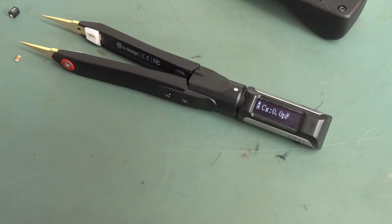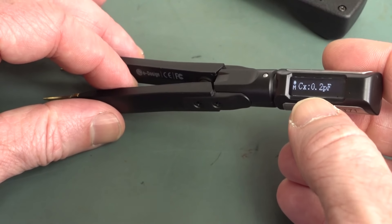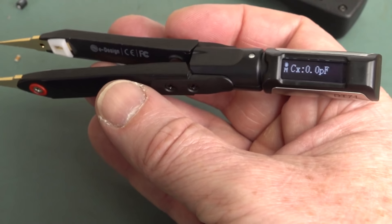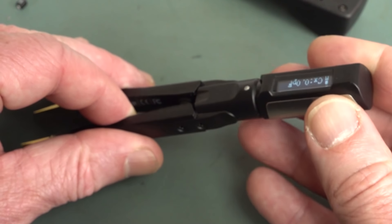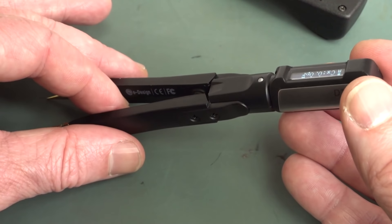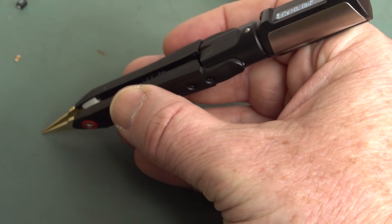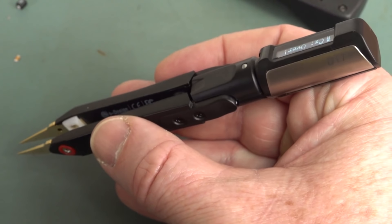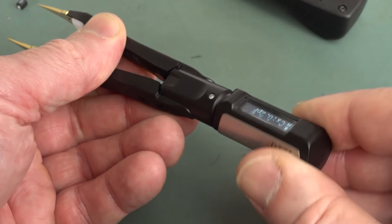It's just basic LCR measurement, plus some extra features like diodes, signal generation, and voltage measurement. But yeah, it's just not as flexible. For the price though, still awesome. One of my criticisms is that the display is just too small. The OLED is quite readable but it is a pretty small display. Another issue is the auto-flip: when I'm using the tweezers tilted, it flips at the wrong inconvenient point. The positional sensor is just not calibrated well enough — it works left to right hand, but just needs a bit of refinement in the sensing of the angle.